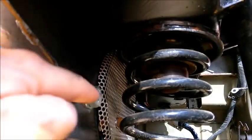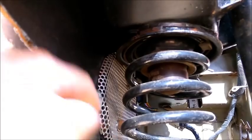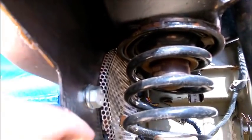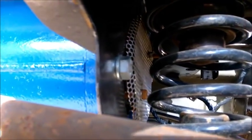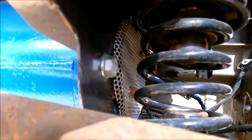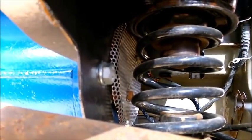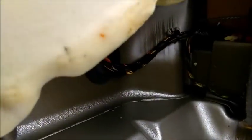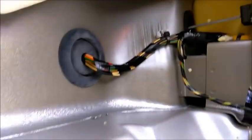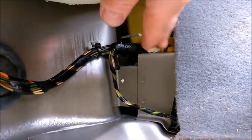I put a cover plate on the end of the motor rather than having the motor too exposed. I kind of formed this mesh I had, and it just about goes in there — it's pretty close to everything, but it's just about going in on the back of the motor. So that will keep the air circulating through the motor without getting stones into it. I'm going to bring the control cables through this back plate, where the normal cables come through, and route them down through the tunnel.